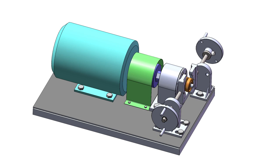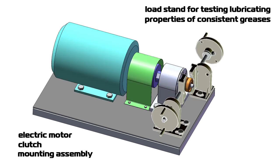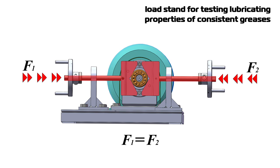Operation of the bearings under load is provided by a special machine. Its main assemblies are electric motor, clutch, mounting assembly, forcing screws, shaft, and two bearings. Each screw creates bending load on the shaft, and these two radial forces counterbalance each other. That's why the shaft is mostly unloaded and barely experiences any bending stress by rotation.